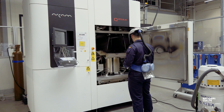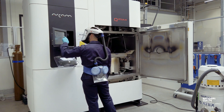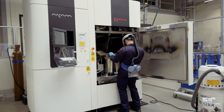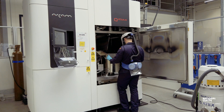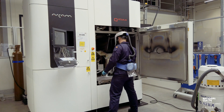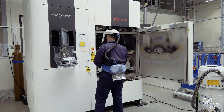The metal powder itself is fed into the system using two gravity-fed hoppers on either side of the build chamber. In this case it's distributing TI-64 powder which has a particle size of 45 to 105 microns. The powder is then distributed using a raking system, and generally it takes three passes to traverse the bed, whilst receiving feedback on each pass with multiple powder sensors that can adjust how much powder is taken. Once the right amount of powder has been achieved, the bed can start to be heated. In contrast to a laser powder bed fusion process, the bed is actually preheated using the electron beam at a defocus setting.